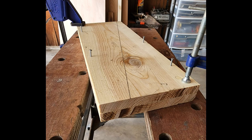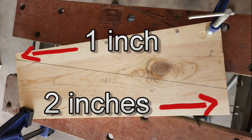In order to make sure that my cuts were the same, I aligned the two sides then screwed them together. As long as your screws are in the top and bottom half inch, you can use them for running assembly screws later. My cut line marks are one inch from what will be the front bottom and two inches from the back top.